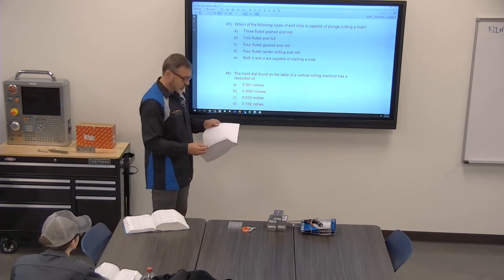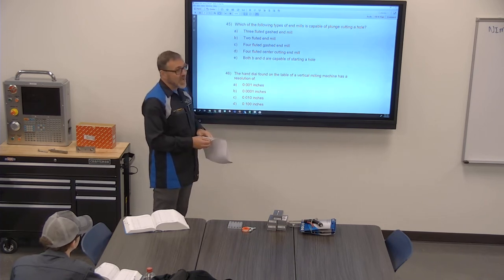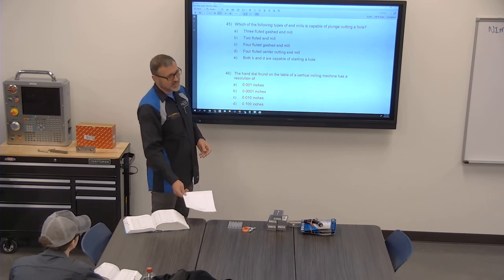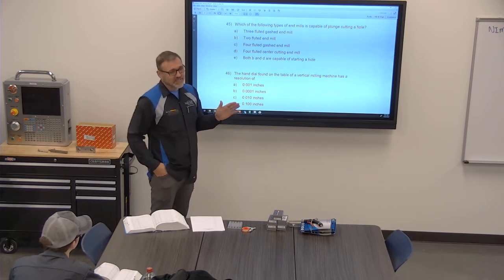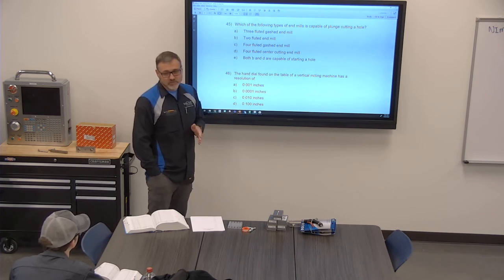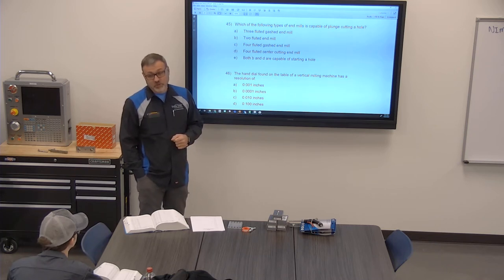Alright, so let's see what 45 actually says. Oh, 45 says E. I would be fearful of that question. It is a dumb question. It is a leading question. People are assuming that the two-fluted end mill is bottom cutting or center cutting. I can go show you one right now that's not. It has a hole in the center of it.